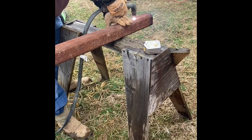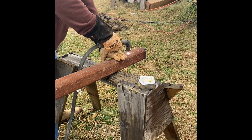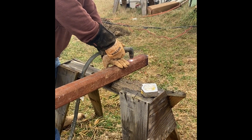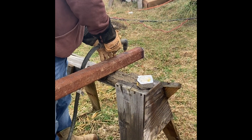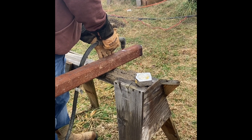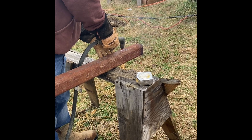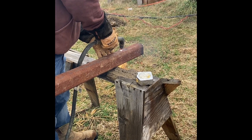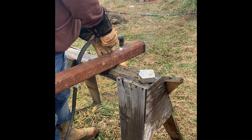As part of the process of pulling the blast valve out, we had to make a homemade gear puller because your local auto parts store just doesn't have anything quite this big. We used a plasma cutter to cut a couple notches in a piece of scrap steel. For the other part of the puller, we had to use two-by-sixes because we didn't have any more scrap steel on site. It takes about half an hour to get to the local hardware store, so sometimes you just have to make do with what you have.